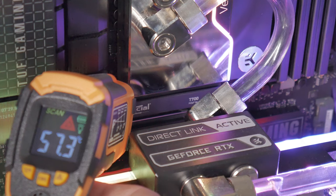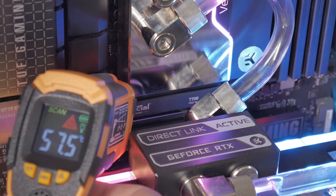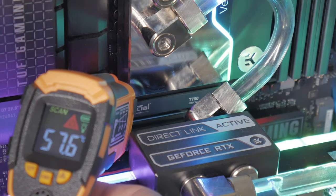The drive does get hot, hitting almost 60 degrees during a stress test, and so that heatsink that you see there is literally the only thing saving it from burning up. It is a pretty good heatsink. It's passive, and that means you gotta have a little bit of airflow in your case, but it's going to manage nonetheless. I thought I'd leave this on instead of the one that came with the motherboard. I believe because of the thickness, this one will be a bit better to dissipate the heat.